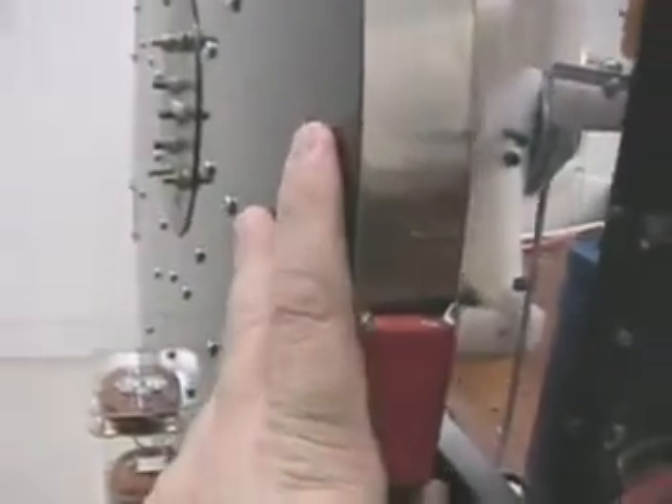These magnets are facing this way. The wheel is only one inch thick and there are twelve magnets. They're double stacked — two magnets that were on the original wheel — and the magnets were facing this way. So the magnetic field strength has increased but I've lost surface area by placing them this way. My issue with the wheel is that it's only one inch thick. When I had a two-inch thick wheel on here it ran truer and straighter, and I'm having a real hard time keeping this one running straight.